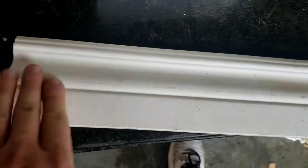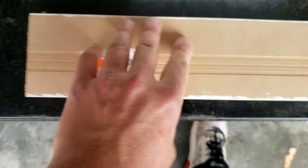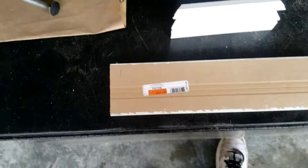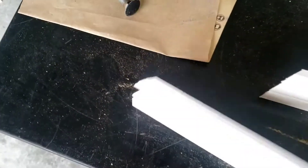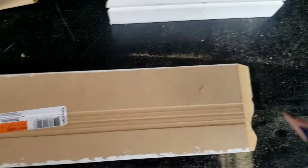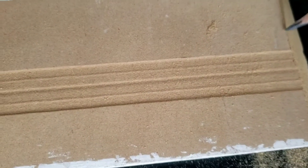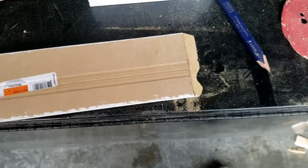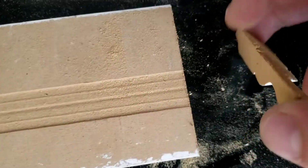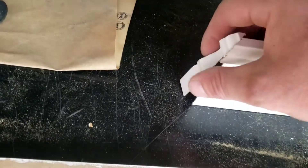Now I'm gonna make my little return piece for this side facing the stairs. You want to take the left side here, flip that over. You'll cut the 45 on this edge — it was a 45 on this side, either way. Take your piece, flip it, 45 goes that way. Now you're gonna want to cut right on that line, right on that edge. Should be left with a little chunk just like that. Throw that right on there, give it a nice little return.